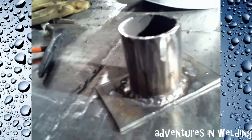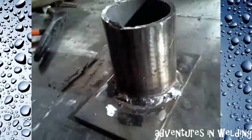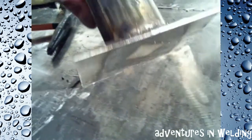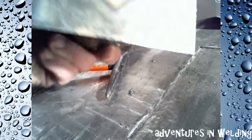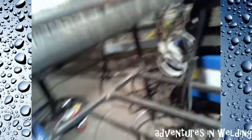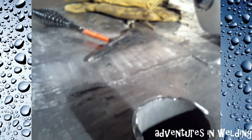Alright, there's our piece — nice and welded up. Decent looking fillet weld. It ain't the most beautiful fillet weld in the world — there's a little porosity right there — but it's a good fillet weld. Now if we look at the bottom, we can see our heat-affected zones. We kept them pretty small — maybe three-eighths of an inch around the outside of the pipe. And if we look at the plate head on, we can see maybe a very little bit of curling at the ends.